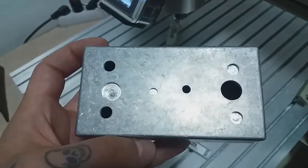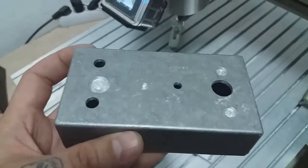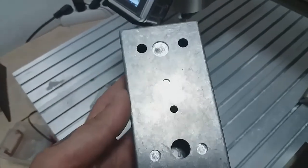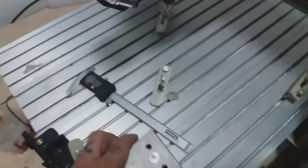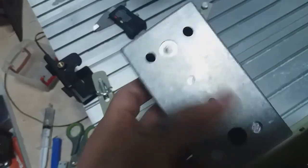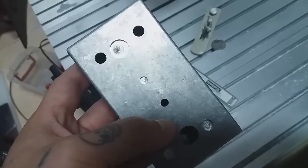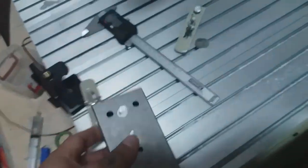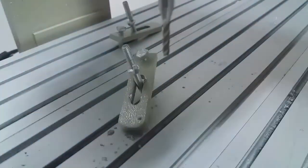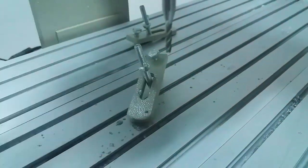It's nice to have everything with such close tolerance and nice to have it done myself. The run time was around 15 minutes — a little bit longer than expected, but that was also my fault. It should be around 7 to 8 minutes. And Jim, I know you consider it totally okay to use a 4-flute end mill, but I'll have to lower the feed rate a little bit more not to clog it.